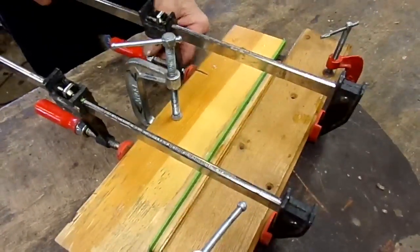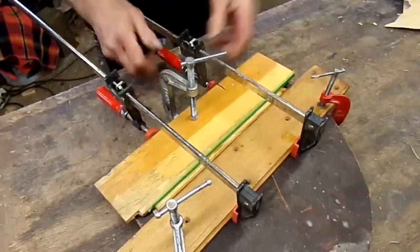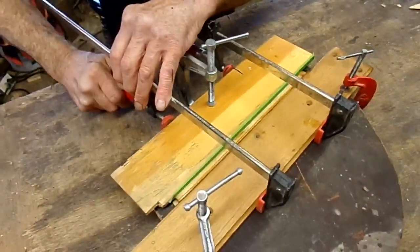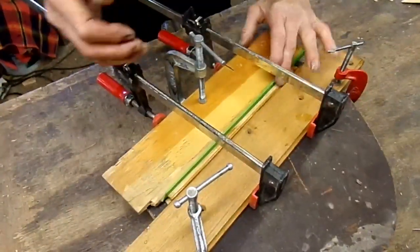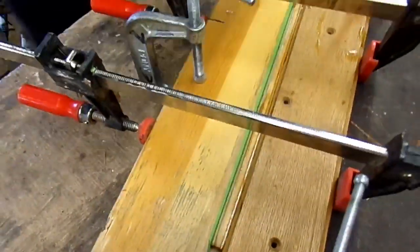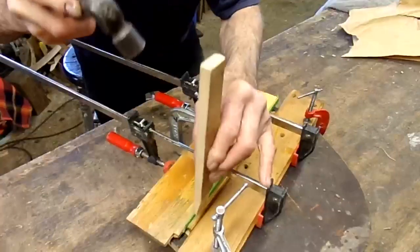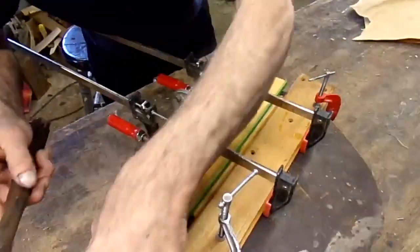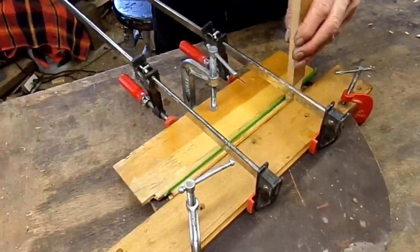Of course, everything has to be glued up. I mean, dry run we call it. We dry run everything. Everything is clamped up like this before, by hand with no glue, to make sure everything goes right. When you have the glue, make sure this is tight here because it'll pop up. Now this looks pretty good here. It lines up pretty well, but I have a stick here to make sure it's down. Piece of pine. Yeah, it looks pretty good. Perfect.